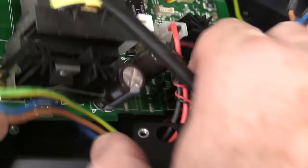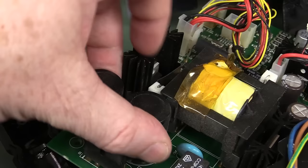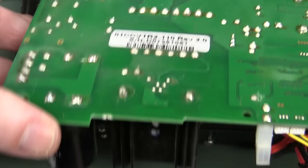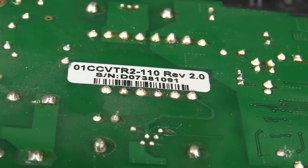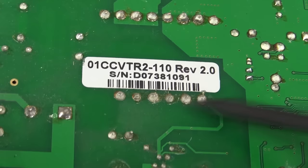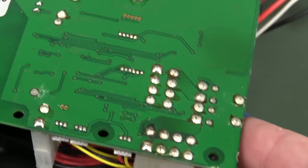That looks quite reasonable - it's got the rectifier set, some protection and filtering on the input. There's our main rectifier cap - Panasonic caps, good brand. Nothing on the underside. Those joints look pretty dodgy - look at those! Dry as a dead dingo's donger! Is that just the lead-free bullshit? It looks pretty crusty - maybe I could clean it up with flux and it might look a bit better. Doesn't instill a lot of confidence, really.